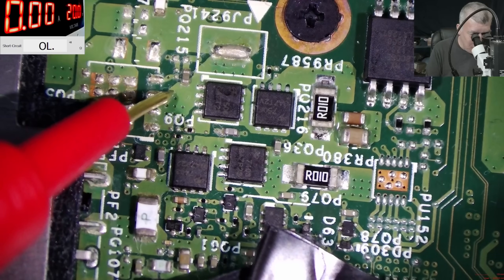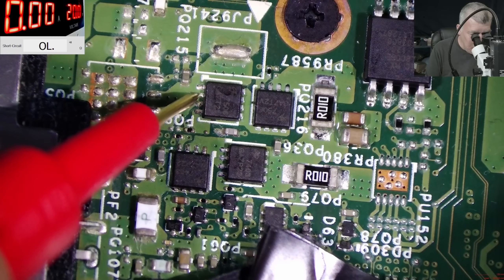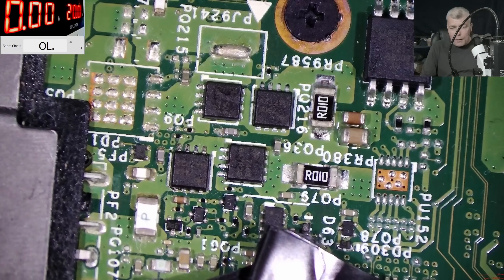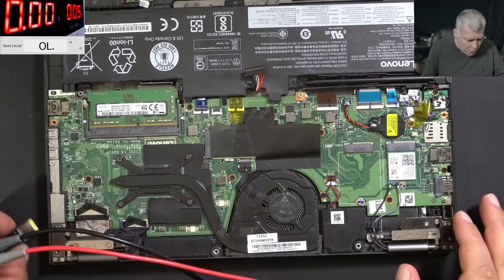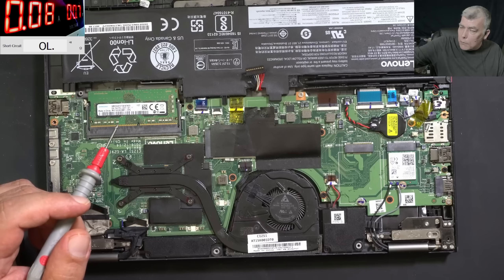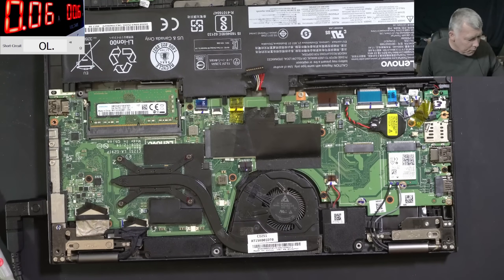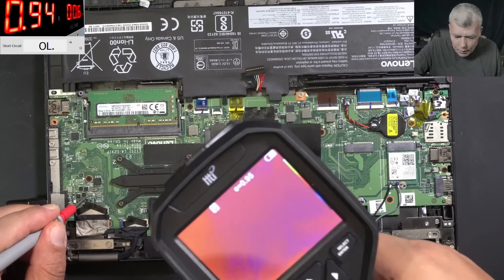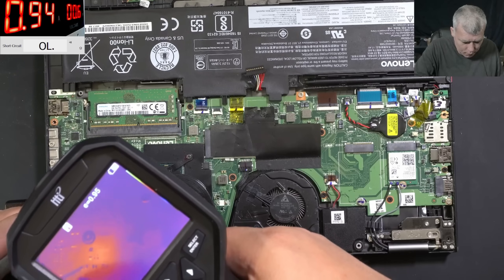I mean, they didn't fit the MOSFET — not sure what was here. But we do have two MOSFETs and a current sensor here. Okay, so the main power rail is shorted. Now, like usual, let's come in with low voltage, or plug the charger because the charger will give me ground so I can use only one probe — like one volt. Let me grab the thermal camera. So we have the thermal camera, current is coming in on the current sensor and it's taking like 900 milliamps, nearly one amp.